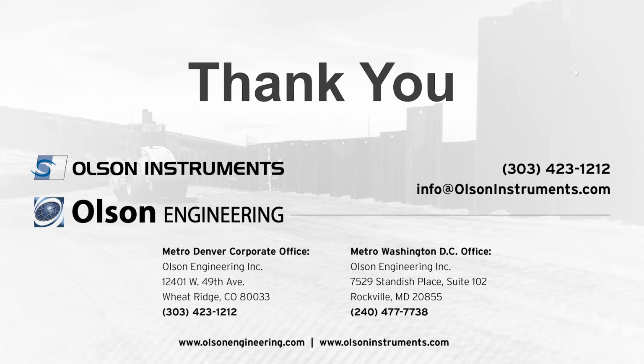So there's a comment that said in Australia they have found that 1.35 times plate diameter is their best result. Right. And Pat agrees with that. He also looked at those stresses with depth and it's sort of the zone of influence, if you will. So here it says Professor Schwartz's study talks about developing a quadratic equation to fit the lab modulus curve. And what is the justification behind that?